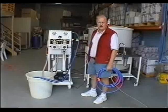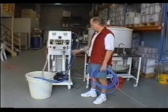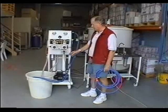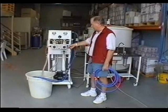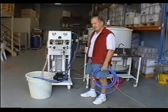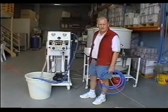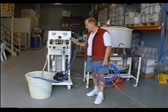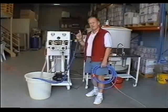Washed every 2 days in areas of poor water, and secondly, the membranes have to be cleaned with citric acid by rinsing with the machine running in reverse about once a week in poor water areas. And I'll now demonstrate the two necessary steps for service of the equipment. Firstly, the carbon filter.